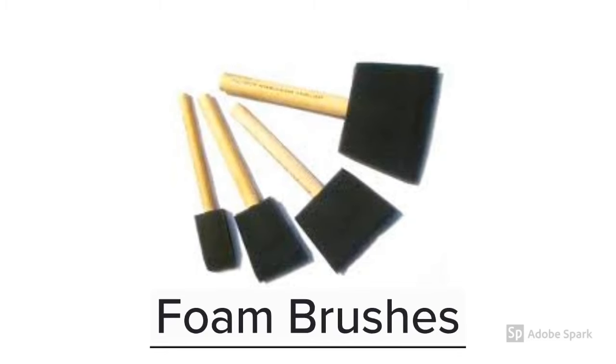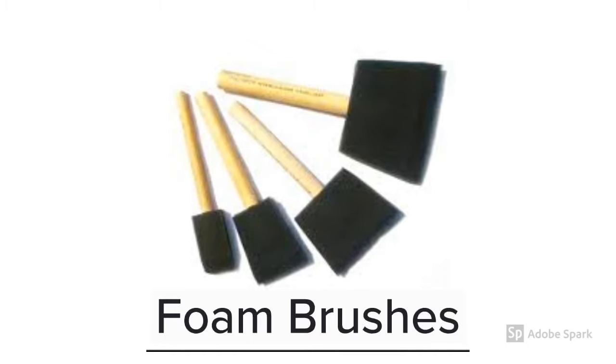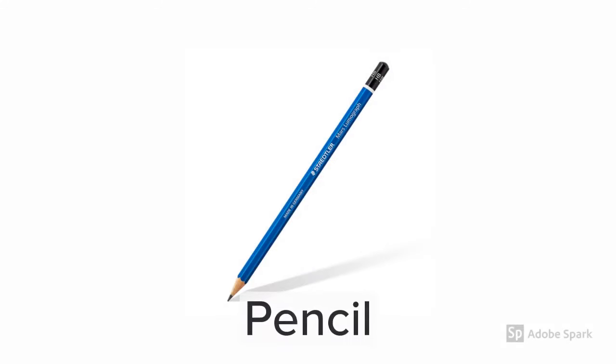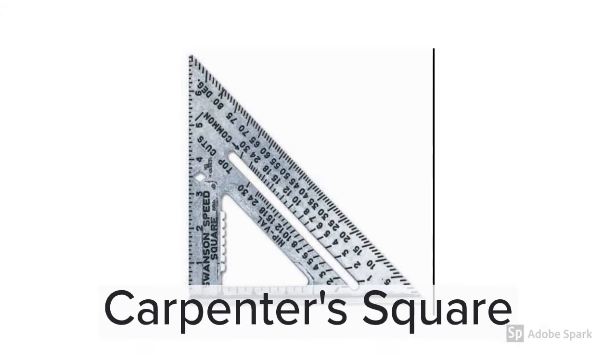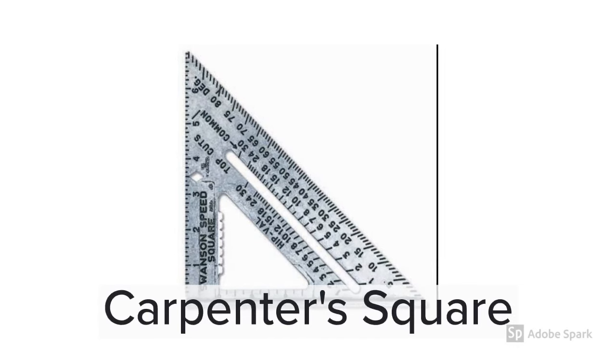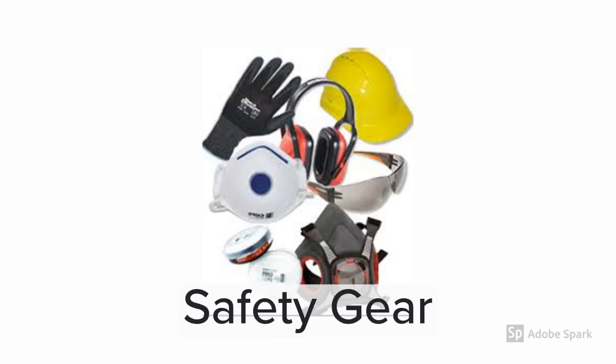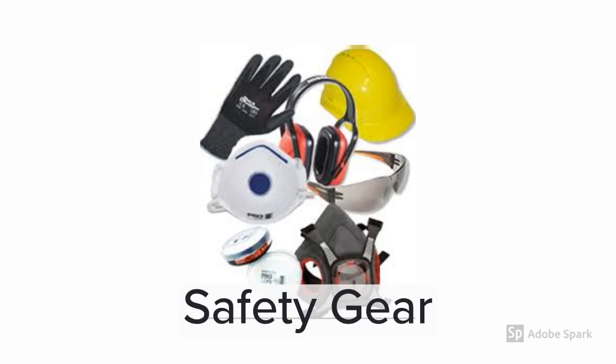I use foam brushes to apply the stain and polyurethane finishes. They're cheap and disposable, and they don't leave streaks or bristles in the finish. The pencil goes hand in hand with the tape measure — this is more of a warning not to use pen or marker, as those are harder to erase and make more work in the long run. The carpenter square is invaluable when making cuts; it lets you draw a straight line between measurements and is the easiest way to ensure accuracy. Finally, safety gear: work gloves, safety glasses, hearing protection, and a dust mask are all things you should always use when doing any woodworking. It might be inconvenient, but you won't think that when they save you from a mistake.